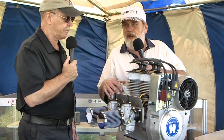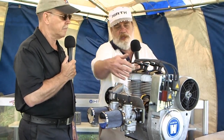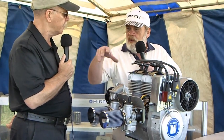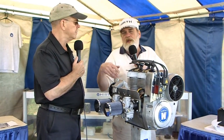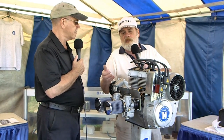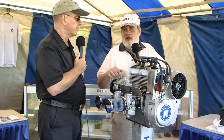This is also good for any experimental single-seater — Cub look-alikes, tractor prop applications. This engine here is made in two versions. The 3202 is 55 horsepower at 5,500 RPM, and that's the one most often used to replace a 503 because it's an inline with the same general offset and length as a 503 — much easier installation. Like the 2702, usually with minor modification to the old Rotax mount, it can be mounted. At 55 horse at 5,500, it's making 10% more power than a 503 at 750 RPM less, and your cruise RPM is going to be about 800 less.